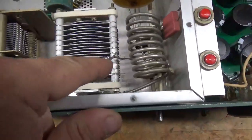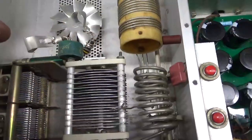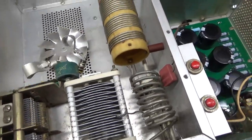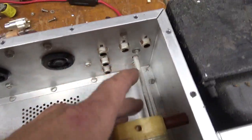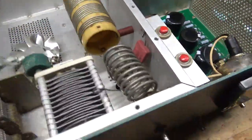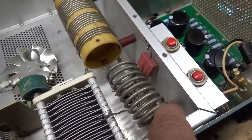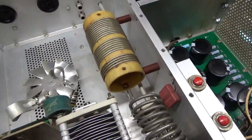I took out the padding cap and the rotary switch below there has the issue. I also took out the screw for one of the standoffs and unsoldered the connection on the rotary switch that goes back to the TR relay and the load tuner. The trick here: I mark the shaft and cut it, then slide this portion back. Otherwise you have to remove the screws for the input rotary and risk damaging it. I'll cut that, slide it back, and pull this whole assembly out as one after I remove this nut. I also took the nut off for the padding cap.